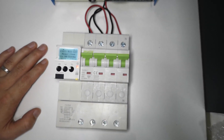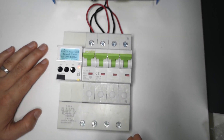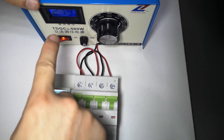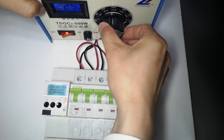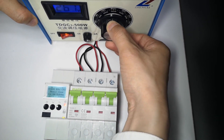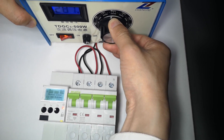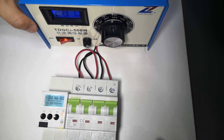Only when the circuit fault disappears will it auto reclose. Let's try the over voltage detection — it's currently around 220 volts. Let's switch up to 280 volts and you will see it will wait for a while at 280 volts.